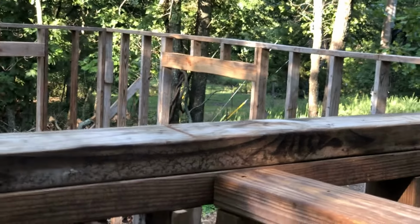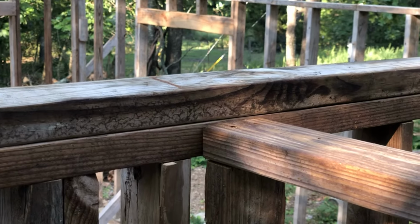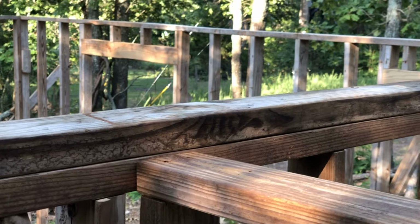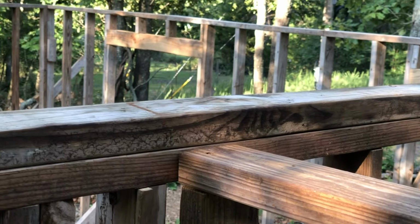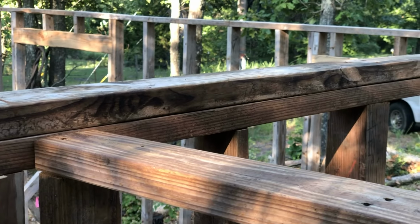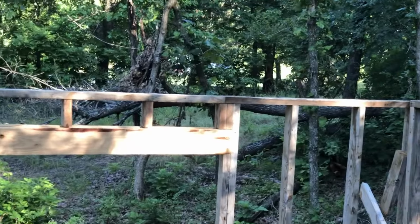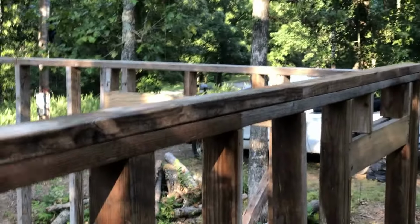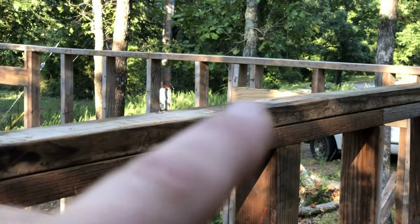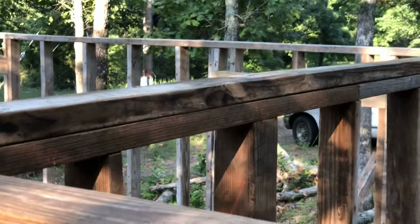I probably won't show you a ton of detail on that. There's tons of videos that show you how to do it, but in essence, it's pretty simple. You just want to overlap the joints. You want to land on the middle of a stud, or flush with the exterior wall, or whatever the wall is. And you want to overlap things. This is the point, to strengthen up the weak spots. Like everywhere there's a joint, you want it to overlap over it. And probably on these exterior walls, even better than I did here. This isn't great, but anyway, you're transferring load, and so there'll be studs above it. The one that really matters is that 4x4 in the middle, because it's transferring the load to the floor, and then ultimately to another pier that I have yet to pour.